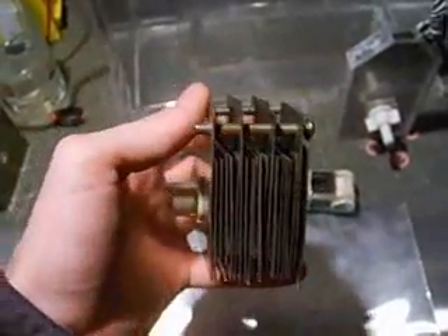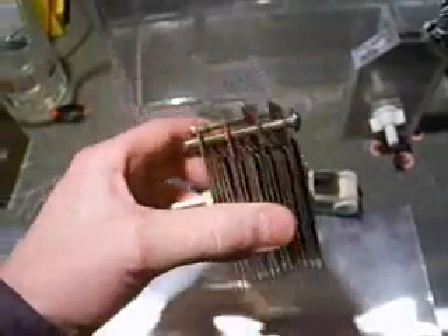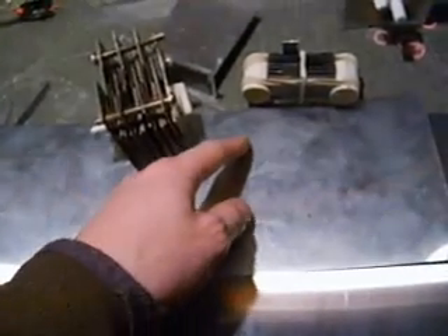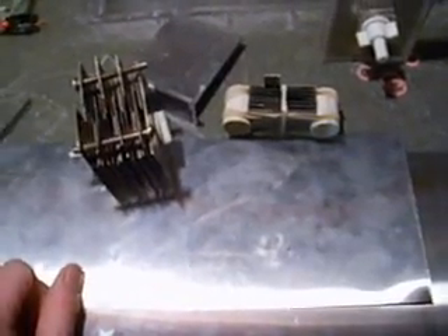Visually, that gives you a better result because it seems to be kicking in with less amps. So you've seen my graphs — you've got your line here. Certain cells, including this cell here, and even more so with neutral plates, have points where they start to perform. This cell here doesn't really do much until you get up to around about 6 amps, then it increases and goes up on a fairly straight line until it dies off at around about 16-odd amps. What's happening is you're taking a cell that would have normally performed up here somewhere and shifting down the performance, so it appears to be doing better at less amps. That's the best way I can explain it.